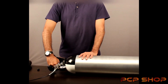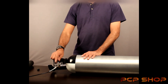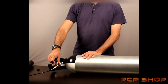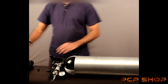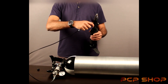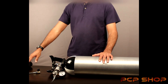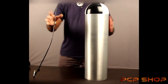I'm going to close the main valve — clockwise — and the valve is locked in place. Now you just got to release the pressure which is between the fill kit and your tank, so I'm going to release the knob anti-clockwise. You want to hear the hiss of air. Then I close that bleed valve back, and I'm going to release the female foster fitting — just pull that back and it lets go. That's how we fill air from the scuba tank onto your air guns or mini cylinders.